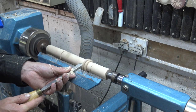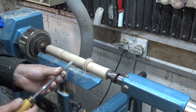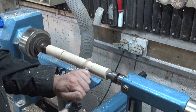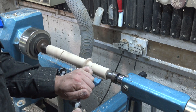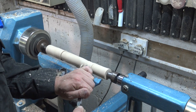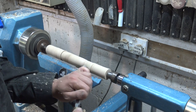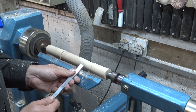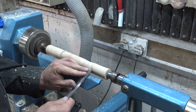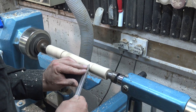I'm just cutting a cove at the moment — you can see my long stringy shavings in front of the cut. I want to meet at the bottom of that cove and blend in these curves by arcing the tool as I go. I only cut with one third of the tool. A far more efficient way of cutting these in my opinion is probably with a spindle gouge. I'll show you a different technique later on when I come to turning the handle for the big meat cleaver.